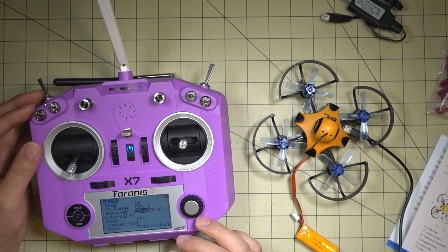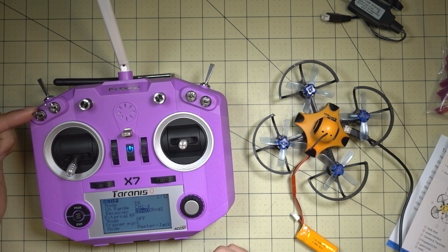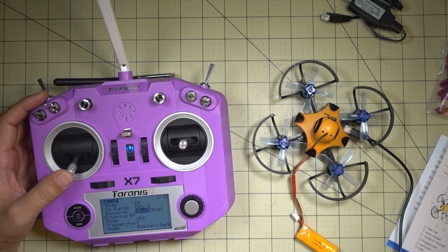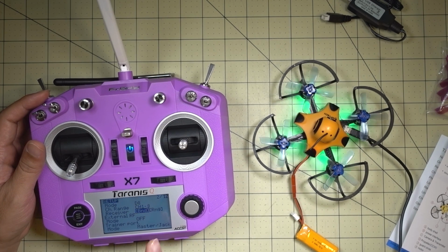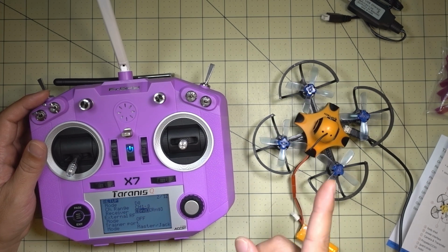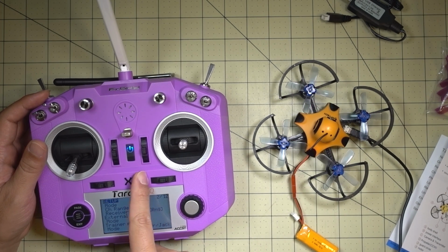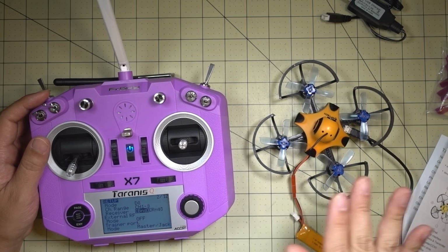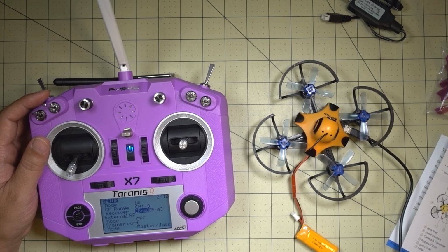I'm actually going to switch it up because I like using a switch for arming and disarming. I don't really like stick arming. But if you don't want to mess with the configuration, you can just do stick arming. Just keep in mind that your channel map has to match what's in the flight controller, so you either have to change it in the radio or you have to change it in the flight controller. In my case, I left my channel mapping alone in the radio and I switched it in the flight controller. So if you do that, then everything should be good to go.